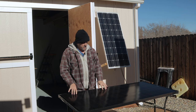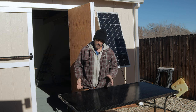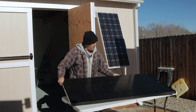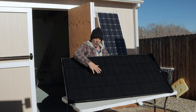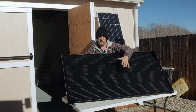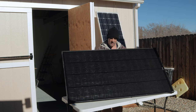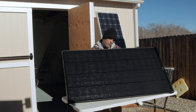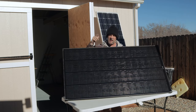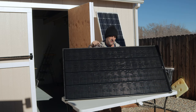If I remember correctly, these panels have 10 bus bars and diodes, which help prevent power loss. If you have a cell that goes bad, or if you have shading — like from a tree branch, or if it's on an RV where the air conditioner shades part of the panel — partial shading is supposed to degrade the output, but with the diodes that's mitigated. I think there are 10 diodes installed; you can check the technical details on the website — I'll put those links in the description.